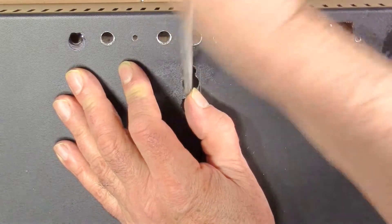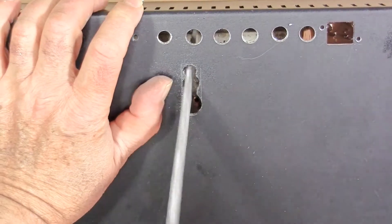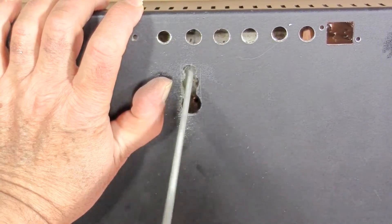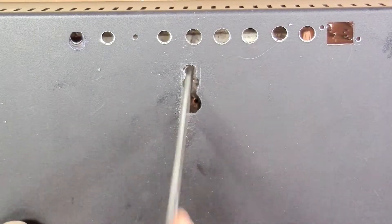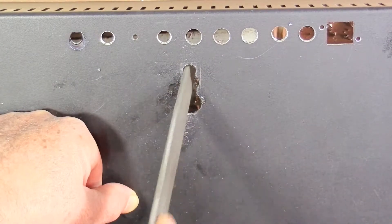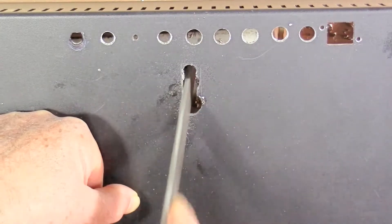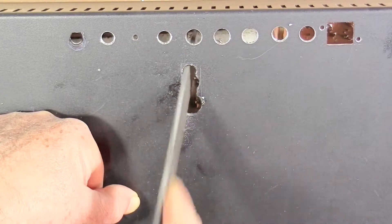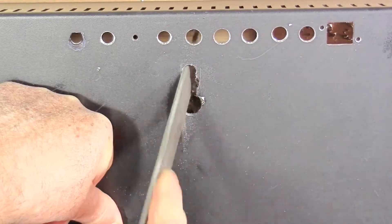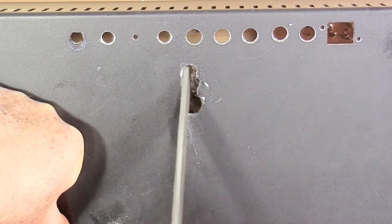Building from that, I wish we'd drilled out more. The more you can drill out, the less filing. I'm using a 12-inch flat file here. We'll try to get rid of as much material as possible with larger files, and then use smaller files for control. There's nothing terribly interesting to say about these things — I seem to be doing a lot of filing. I do more filing for this project than the IRS on tax day.